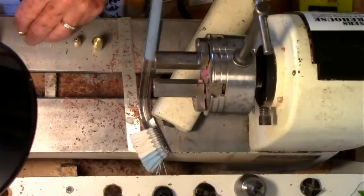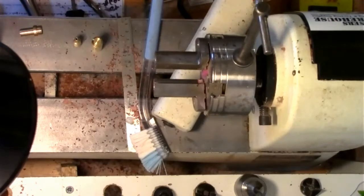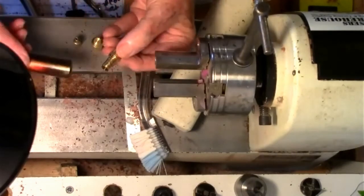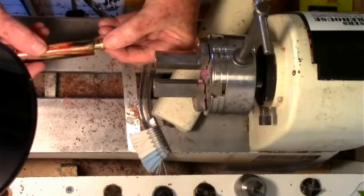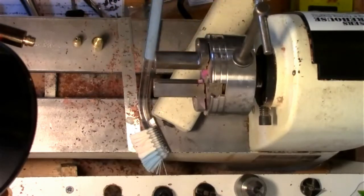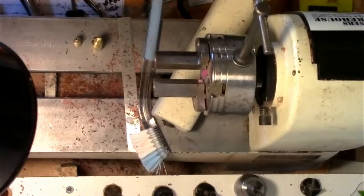And what I would normally do is use epoxy to put this in. But because we don't have 2 days or a day and a half to do this, I'm going to use thick CA to glue this in. All I'm going to do is coat the barrel of the insert with thick CA. Put it in. I'm going to get a paper towel first, to make sure that we don't have any bleed out on the brass.